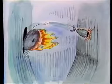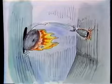Flame impingement can be detected by discoloration or blistering of boiler tubes in the burner area. Fuel impingement is found in the same general area as flame impingement and causes tube erosion. Look for this erosion as well as fuel accumulation to detect fuel impingement. Another case of fuel impingement is faulty burners that throw unburned fuel across the furnace. If you find fuel impingement, you're likely to find flame impingement as well, so be on the lookout for both.